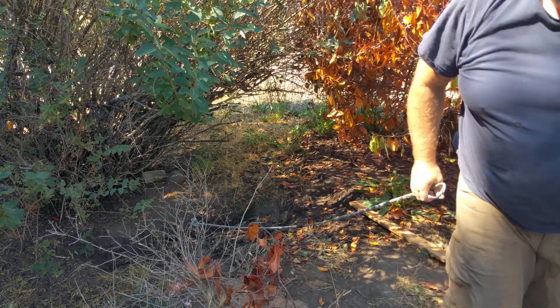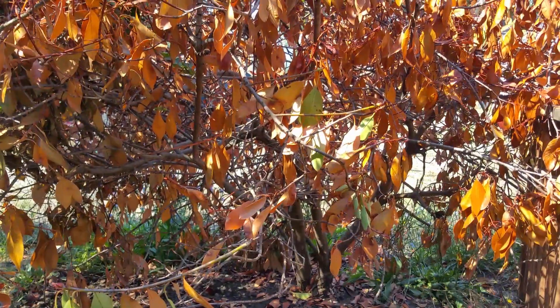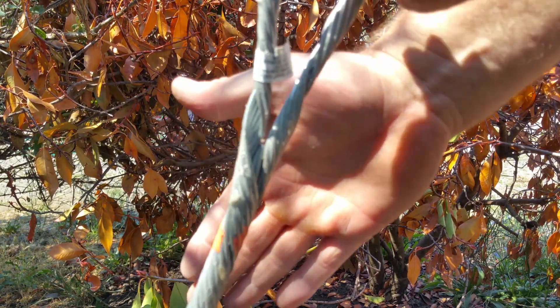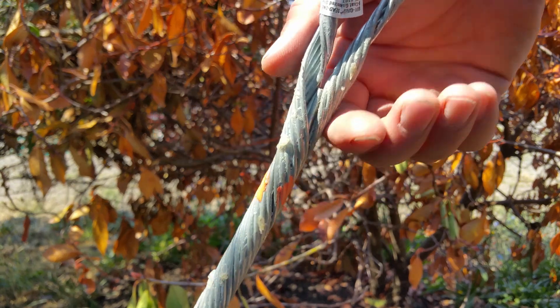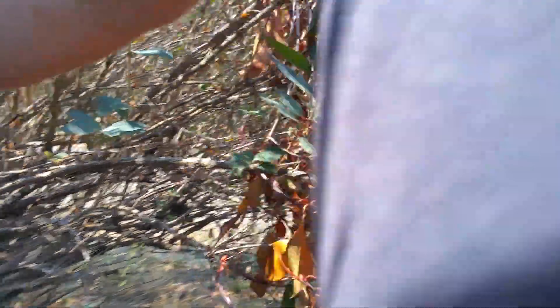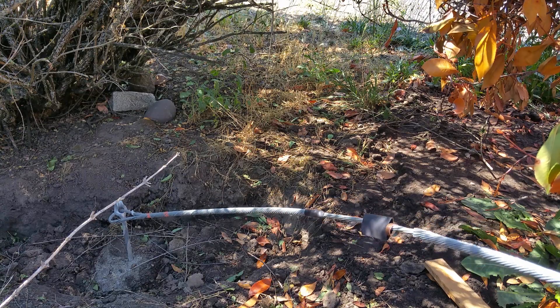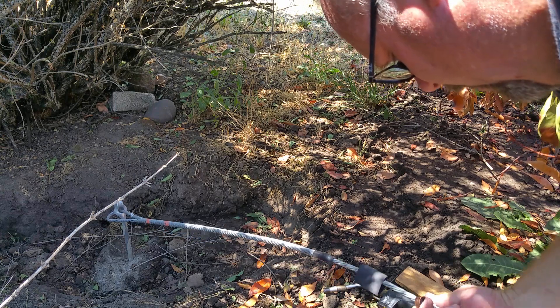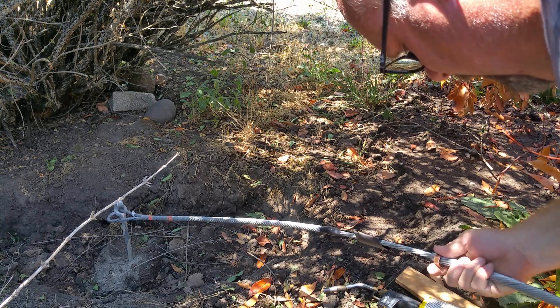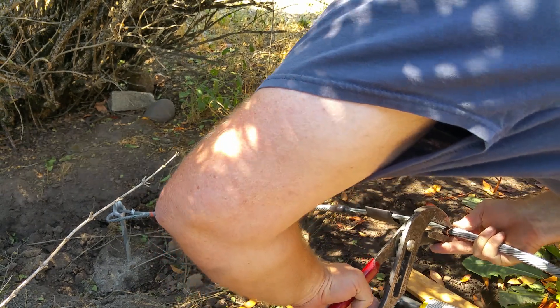Then I make a copper end — I'll bring you guys in close for that one. So you can see this end right here. The cable comes up to right there and you can see the paint marks. We're going to be making up that end right there. I've got a small copper ring — all it does is keep it from unraveling, not to hold it in place. So I take these giant, ridiculously giant pliers and crimp the copper ring over until it's flat.